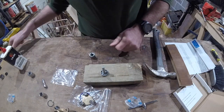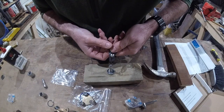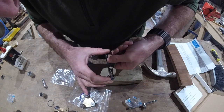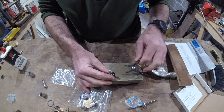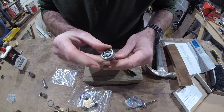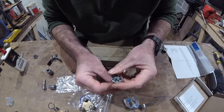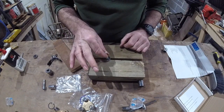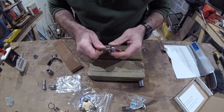New circlip. The right tool for that job is a pair of circlip pliers. There we go - it was easy that time. So that circlip is properly seated in there. I've got the second bearing in - it took a bit of coaxing, not brutalising, just coaxing. I've had to rest it between two bits of wood so the slot goes down through the wood but this bit rests on the wood. Not ideal, but it's in.